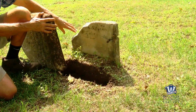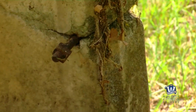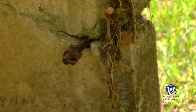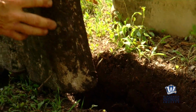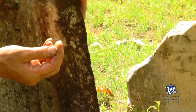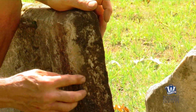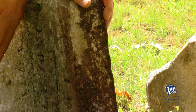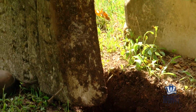But unfortunately, for whatever combination, in the case of this, a mild steel is going to expand and crack the stone, and so this has unfortunately failed. Now the next thing we see is, because this has been in the dirt so long since it was broken, fixed, rebroken, that it's an incredible amount of sugaring. See, with my bare hand, I can touch it, and the stone is coming off in my hand. The term is sugaring, see that? And a more technical term for that is granular disintegration, and it means the stone has lost its structural integrity, and so it no longer has strength, and it's just kind of falling apart.